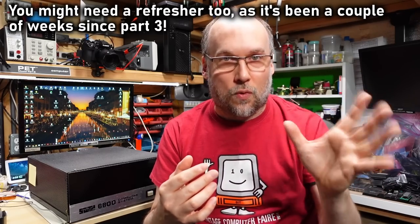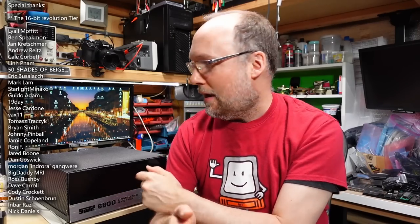On part 3, I worked to get the 4K RAM expansion board working. It turned out there was a bad RAM chip on that board so I could only use half of it — 2K — and unfortunately 2K is not really enough. So in this video, I'm going to test out not only the 16K RAM card that also came inside this computer, but I'm also going to show off a little homebrew RAM card that I made myself. I'm also going to test out a ROM upgrade and a few other things on this machine.